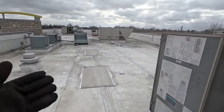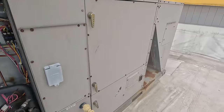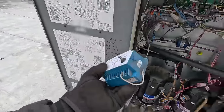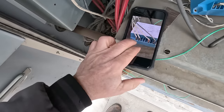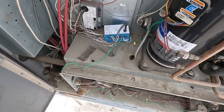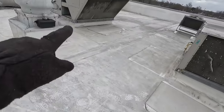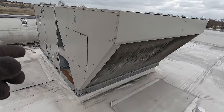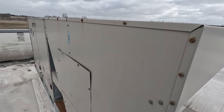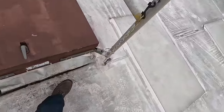So now as far as the other one over there, I'm going to go downstairs and see if it's okay or not — if it's still not problematic, we'll catch it when we come back. There's W2 — now we're kicking out some more heat. I'll go ahead and give them a model and serial number of this thing so they can cross it over — I'll even give them a picture of the new one. I went ahead and just copied the info back over. We've got it hooked back up, and if I lose the picture we can just swap it out. I'll go ahead and write 'bad' on this thing. Let's call this done here on this one. The air conditioning was running because when Y2 is calling, that usually forces mechanical cooling on. With it being 26 degrees out, the snap disc would be shutting down the compressors. Let's get this module ordered and get off the roof.